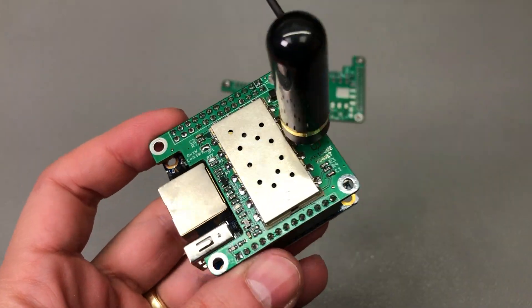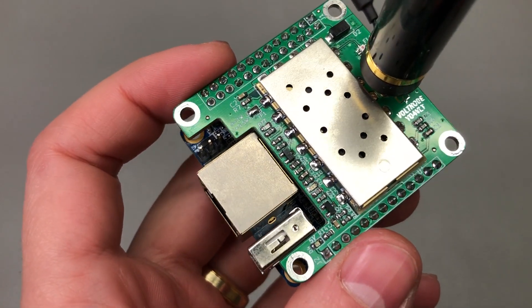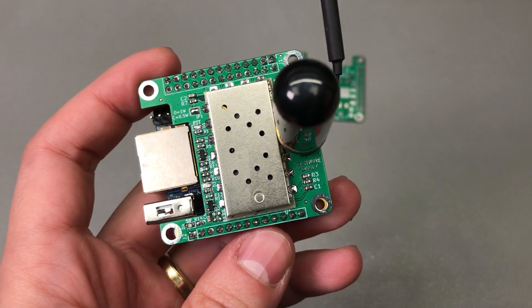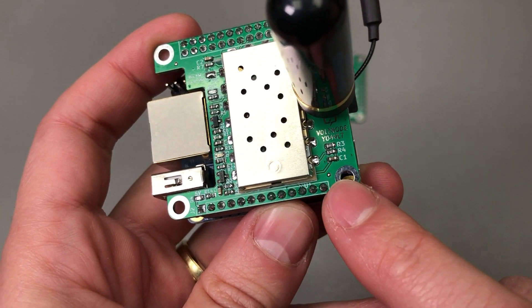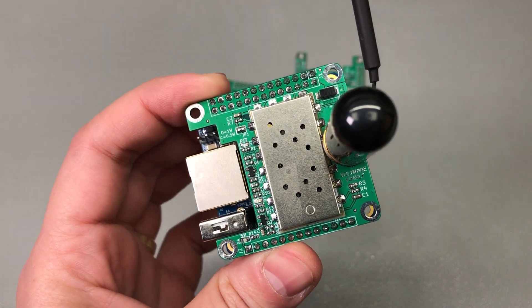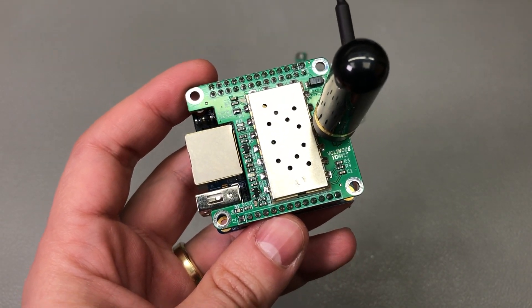There are a few things which could be improved in a future revision of this board. Number one on my list — reported by Yankee Oscar 7 Golf Quebec Zulu via the Rowlink community page — is that the mic negative input on the Orange Pi Zero is left floating, which could lead to input noise being amplified. The simple fix is to add a capacitor-resistor filter to ground on that pin, which can even be done as an afterthought since there's enough room on the PCB. I haven't noticed anything wrong on my unit but results may vary depending on your power supply.